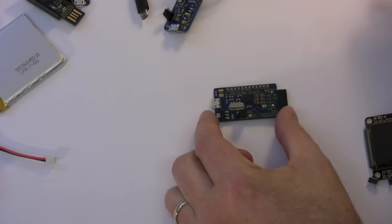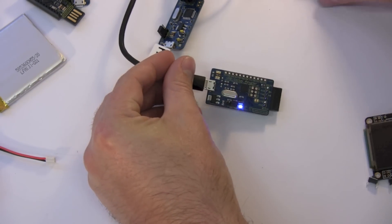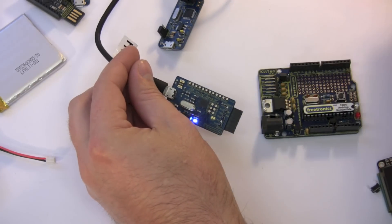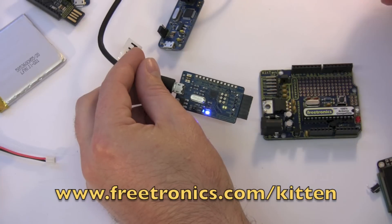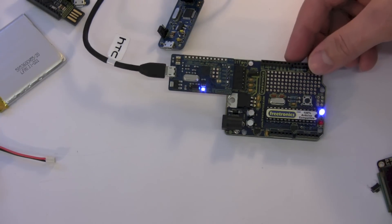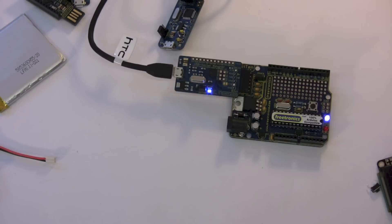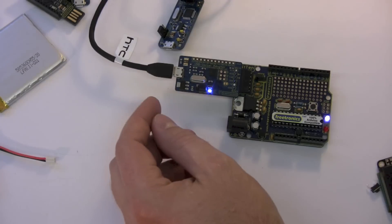I'm going to give you a little demonstration. At the moment it's in the 5V position. I can plug it into a cable from my computer. Here I have an Arduino compatible board that doesn't have its own native USB — this is a Kitten, a kit-based Arduino compatible board with a header for an FTDI cable. It runs on 5V. I plug that in and you can see it's powered up. By default the Kitten is running the blink sketch. I have a copy of blink open here set up to run at 10 times a second instead of once a second. I click upload — it's compiling, uploading — you'll see the activity LED flicker. And now blink is running, flashing 10 times a second. That shows we've just uploaded to that board.